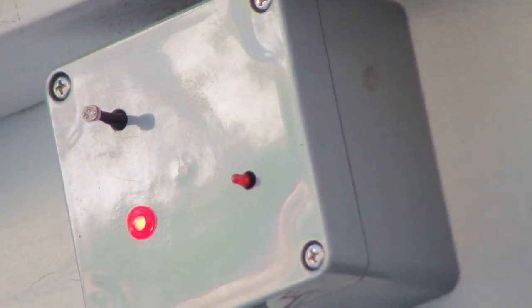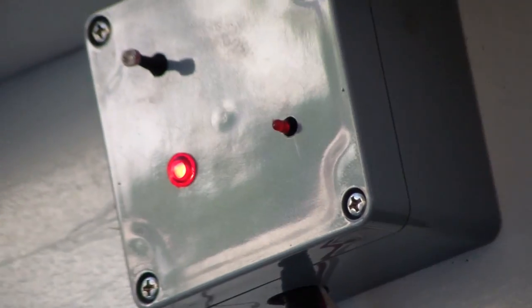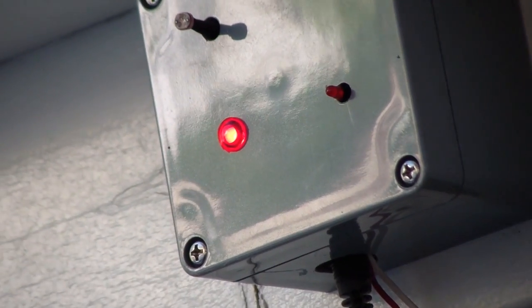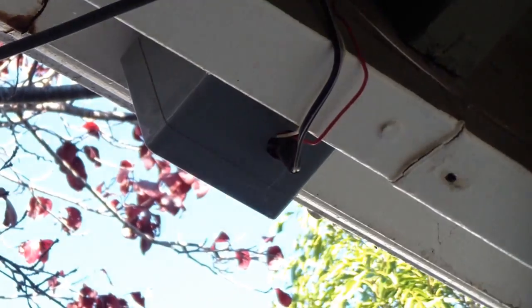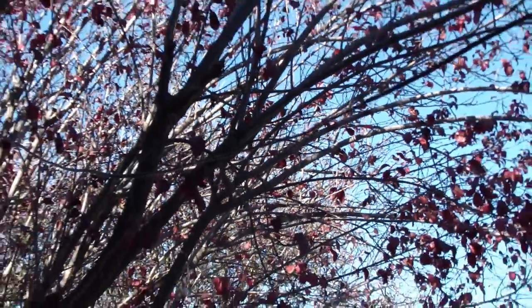The other LED comes on when the relay goes on and the lights come on, and the standby LED goes off. I brought the power from the battery bank into that connector there. It's an 18 gauge, three wire sprinkler wire. I used one ground for common in between the two live wires coming in — one goes to the sensor and the other one goes to the LED lights I put around the tree.